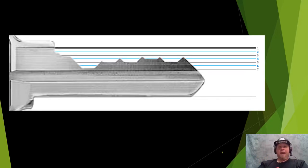Now that I have the depth cuts, how do I model a key? A lot of people don't have the skill to get the warding cut and proper dimensions into something like Fusion 360 or SolidWorks. That's where a great talk from DEF CON 21 comes in — key decoding and duplication of high-security Primus locks. The people who created that talk also created a software called KeyGen and launched the website keygen.co. This website is absolutely amazing.